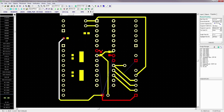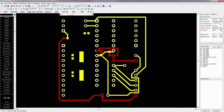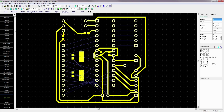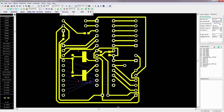Since there are not many traces here, I decided to make it one-sided. I placed the through-hole components like the connectors and the microcontroller on the bottom side, and the surface mount devices on the top layer as well as the traces. This will obviously be the copper side of the PCB. This time I did the routing manually. Luckily I didn't need any bridges or vias.